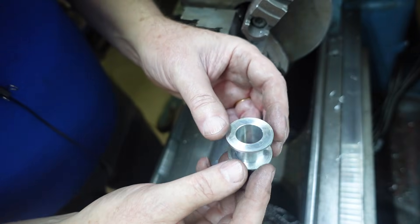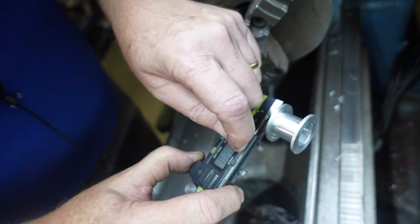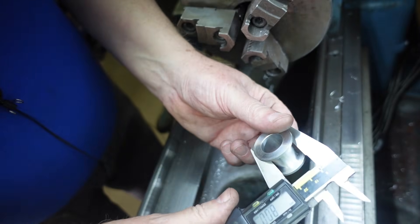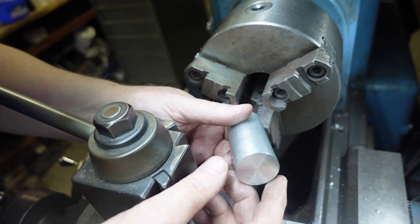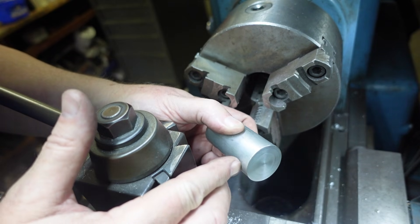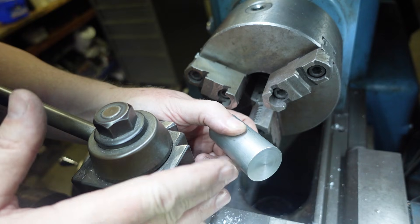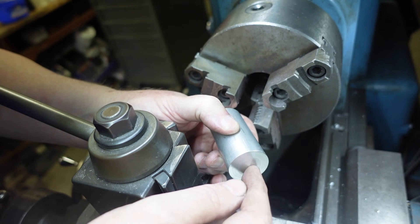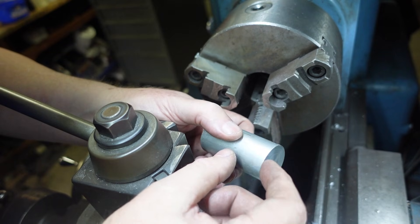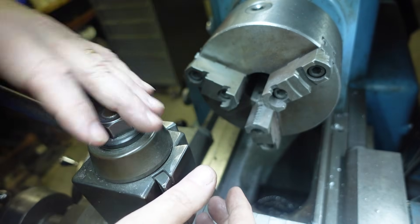Supposing you want to make a part like that. At first glance that doesn't look too difficult, but if you put that into millimeters - zero that and then measure the OD - that's a one millimeter thick wall either side. Two ways of doing that: one way might be chucking up your stock, putting your groove in, and then finishing off with a hole before parting off. The reason for doing the hole afterwards is that when you're plunging in you're going to be pushing the material away from the tool a little bit, so if you've got a hole there it may distort depending on the wall thickness. You get a more accurate part if you drill afterwards. But if you haven't got the length of material to hold it in a chuck, you have to have another way of doing it.